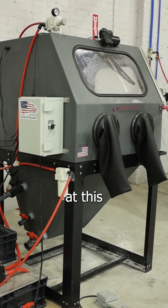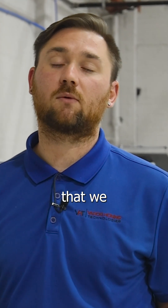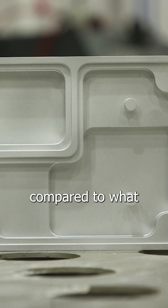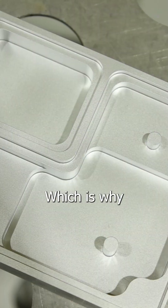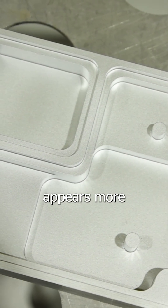you may want to take a look at this, because this is going to help you tremendously. Obviously this is a part that we machined ourselves — we're leaving it bare — but this surface finish is impeccable compared to what it looked like before, with all the tooling marks and sharp edges. Ceramic bead is round, so it's just going to roll the surface, which is why all of these different areas are smoothed out and the finish appears more satin.